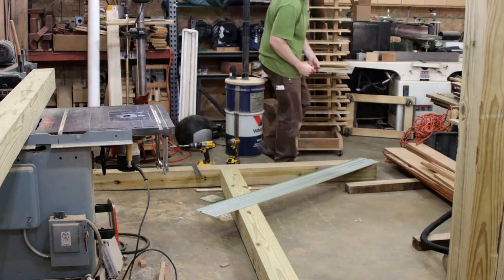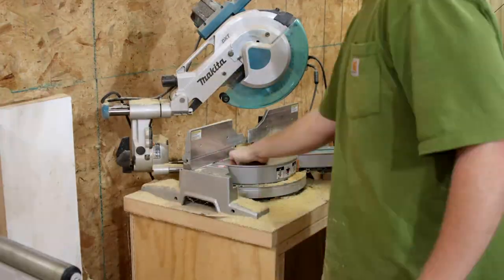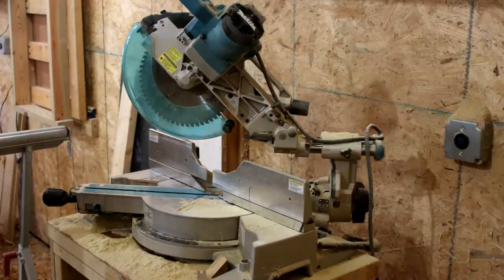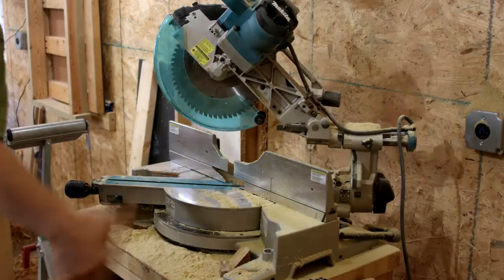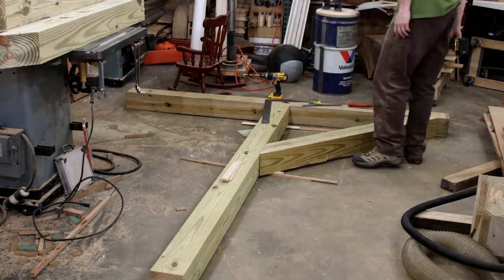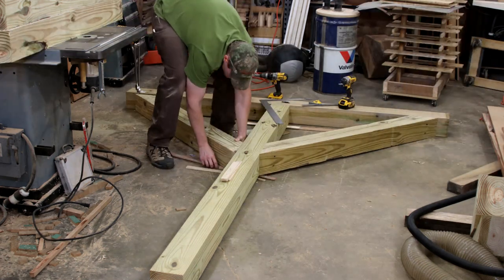I'm measuring the brace right here — it's just going to be a 45-degree angle brace, same process I used before cutting the 45 angles. You're seeing me cut a whole bunch of different angles for that. It's important to get these as close to 45 degrees as possible so that you don't have any open gaps that would cause any tension problems once you put weight on the crane. I've got my square there and I'm checking constantly to make sure that everything is as square as I can possibly get it.